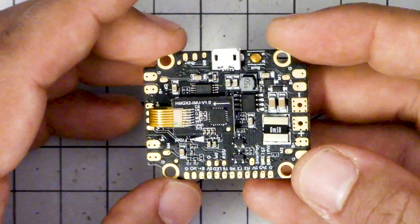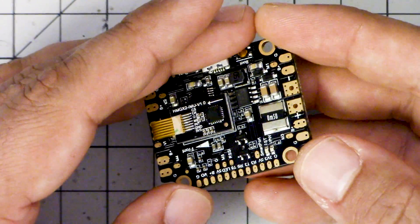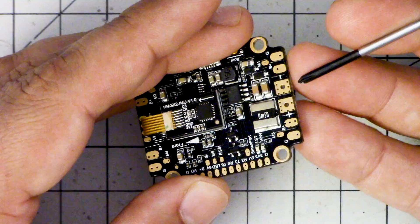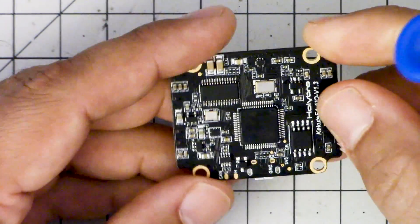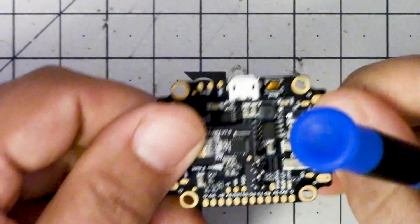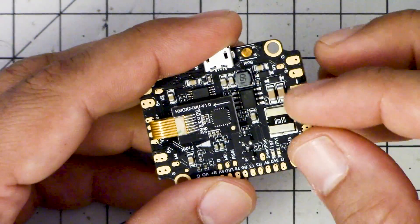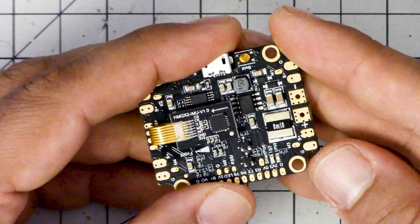The problem with this board is that the first 500 or so of these boards that went out had a 60 amp maximum on their current sensor. It turns out that the range of the current sensor is actually set by the value of two resistors — one of them is the shunt resistor, and the other is, I think it's called the gain resistor. The value of these two resistors together determines the scale of the current sensor. The board designer can choose to have a large scale with less resolution, or a small scale with more resolution.